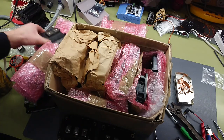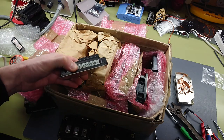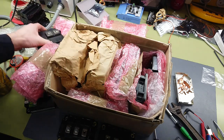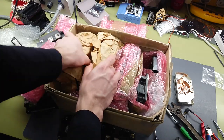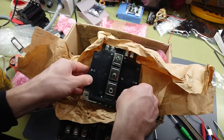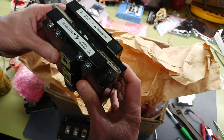And as you can see there are lots and lots of bricks here. I plan to use eight of these put up in a dual full bridge in parallel, and here we have some you might recognize from the large Tesla coil — the spare dual CM600 bricks I have for that.